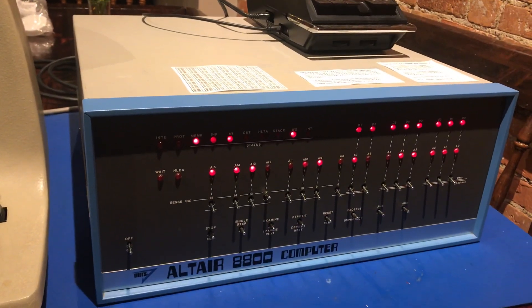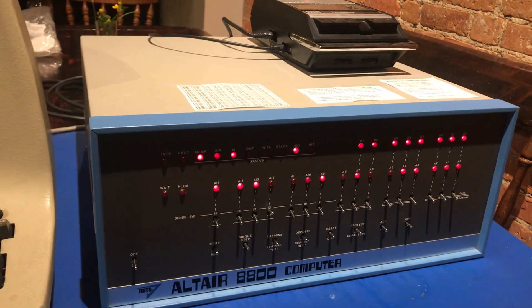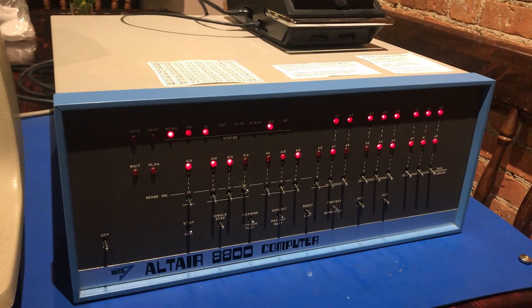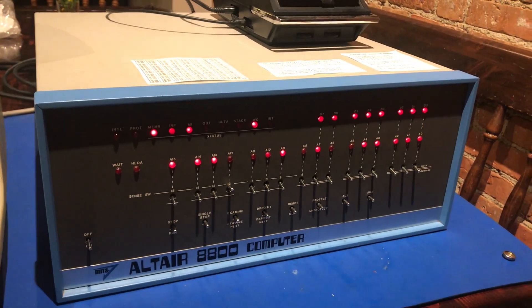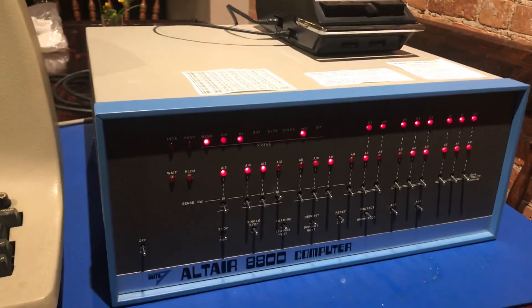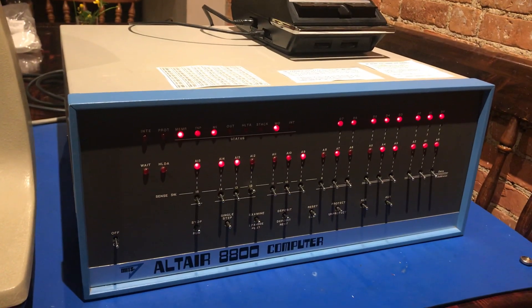This system has been a little bit of work. The backplane needed some rewiring, and I think the front panel had a bad piece of logic — something was stuck, a stuck bit. I had to remove a fair amount of power supply modifications to restore it to its original state. It does have its original power supply, but there was an extra transformer and some extra capacitors that were pretty precariously installed.